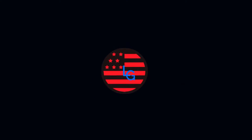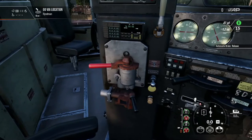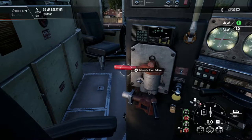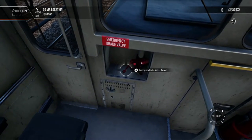Let's see how exactly the automatic brake works. It controls your cars in the back and also controls your locomotives, but there is a way to bypass that and we'll get to that in a little bit. You can see here that the automatic brake is red — that indicates it is an emergency brake. On this side it says 'emergency brake valve' and that's red also.